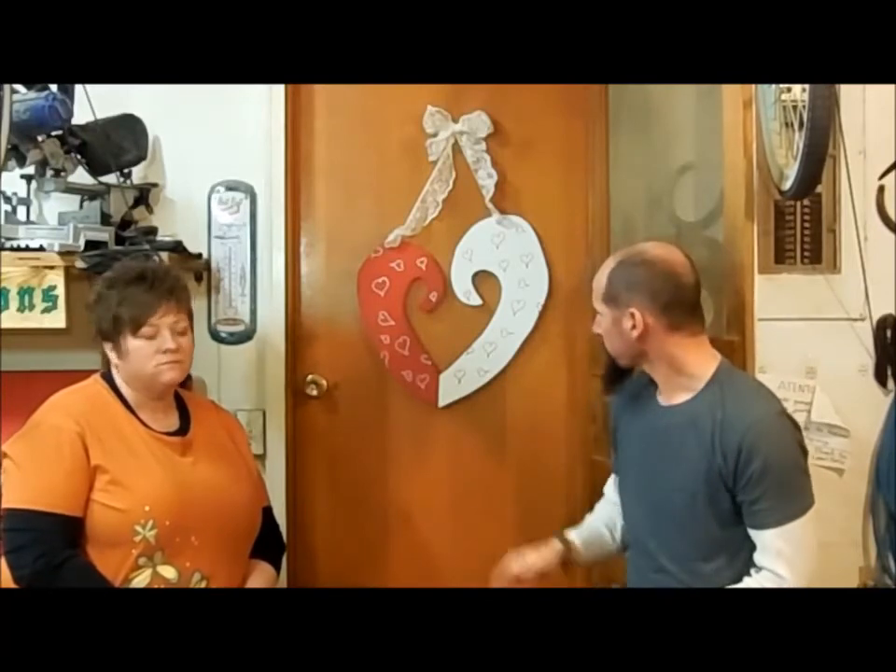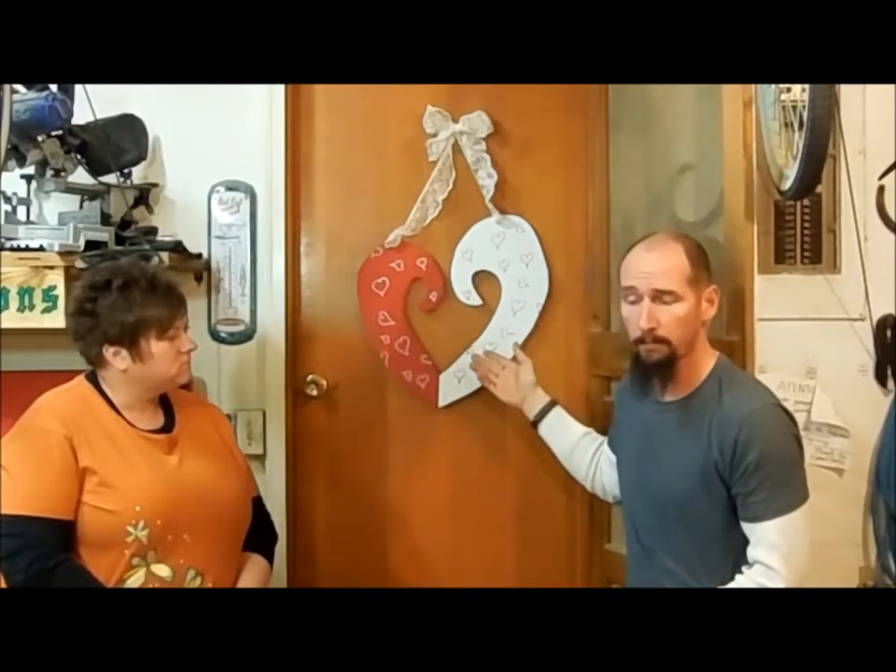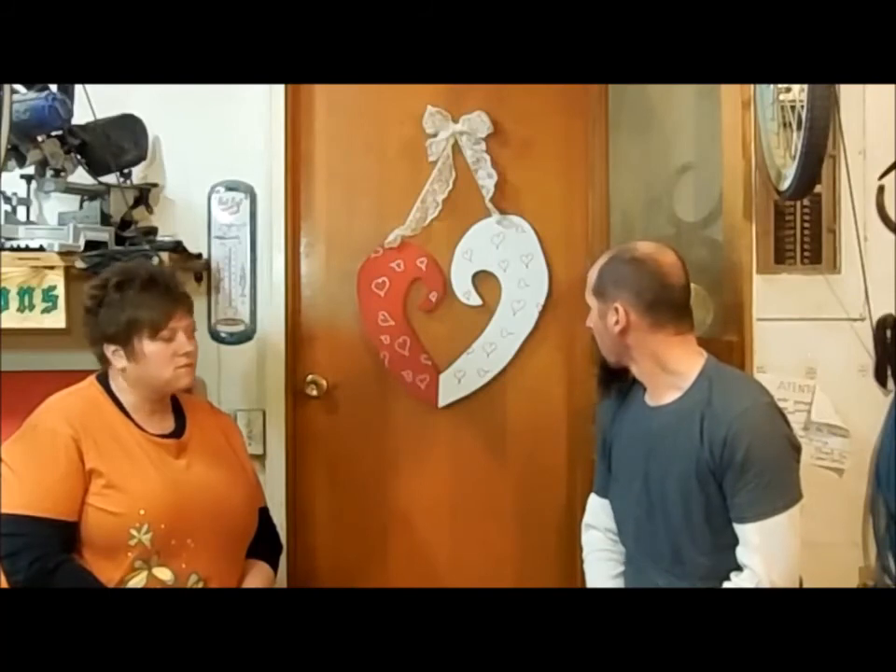Alright, there you have it — a nice, simple project. A little bit of time on the weekend, not much. Now this is inside my shop, but it'll be on a front door protected by a storm door. If you're putting it on the door outside with no protection, you'll need to put a sealer on it. When using craft paints, I've found that if you take a spray-on sealer and apply literally less than a regular coat and let it dry, then put a few coats on like that, you'll protect it just fine. It's an affordable decoration — it has a unique look and it's an eye-catcher. That does it for this episode. I'm going to try to keep one more Valentine's decoration episode out this week. Any comments or suggestions, I'd love to hear. Thanks for taking time to watch our video. Please subscribe.